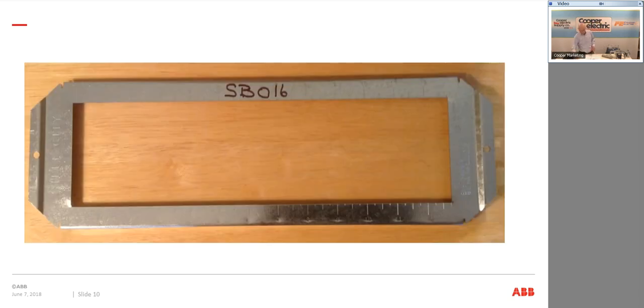The next item is my mounting bracket for mounting 4-inch square and 4-11/16 boxes between studs. Formerly, you'd have to get a telescopic bracket — you've sold them in the past. You'd have to bend the tabs to either a 4-inch or 4-11/16 box depending on the depth, then tech-screw it to your bracket. Very time-consuming and costly with labor. And if you have to make a change, you'd have to remove the tech screws, move it over, and re-tech it in.